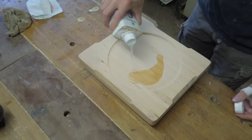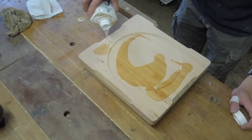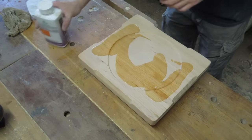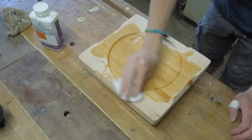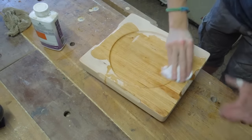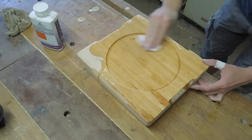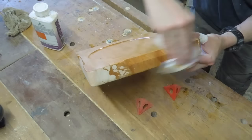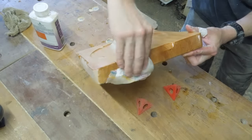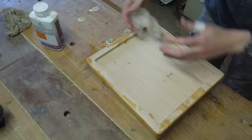I'm using my favourite food-safe oil to finish this piece, and I leave it for about 15 minutes to soak in before I wipe away the excess. In all I think I applied about 4 coats. Although I am using painters pyramids here, I have grown to dislike them because the points leave small indentations on the work in my experience.